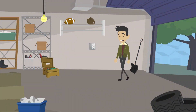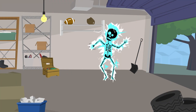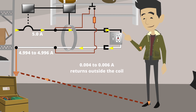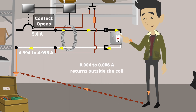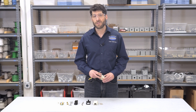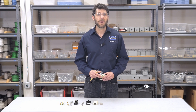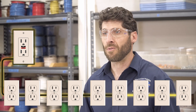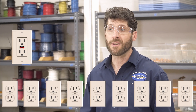In this animation we can see that the GFCI is detecting a current imbalance. When the man touches the housing he becomes part of the circuit, creating an imbalance of 0.004 to 0.006 amps, and thus will trip the contacts in the GFCI. If the shell or housing of a piece of equipment or appliance has become electrified, the GFCI will detect an unequal load imbalance in the range of 4 to 6 milliamps. When this occurs it will happen in fractions of a second — roughly 25 milliseconds — and the GFCI will terminate power to itself and loads downstream, thus preventing electric shock.